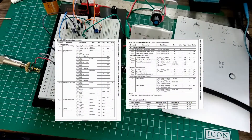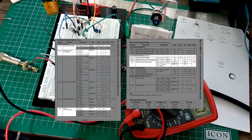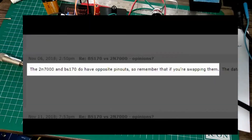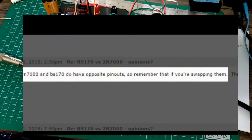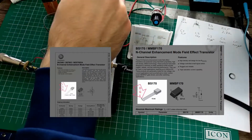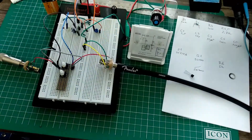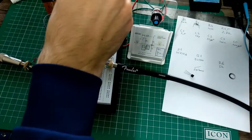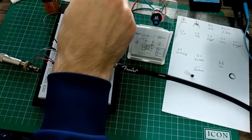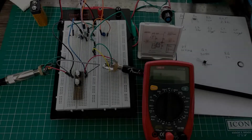After I failed to make it work, I went back to the datasheets. The parts looked pretty much the same — all parameters are pretty much the same. Where do I go from there? Google, of course, and after a bit of searching, look what I found: different pinout. No way — sure enough it is, because I just assumed they'd be the same. Lesson learned: read the datasheet. But I read it — then pay attention to what you read. I made a mess.